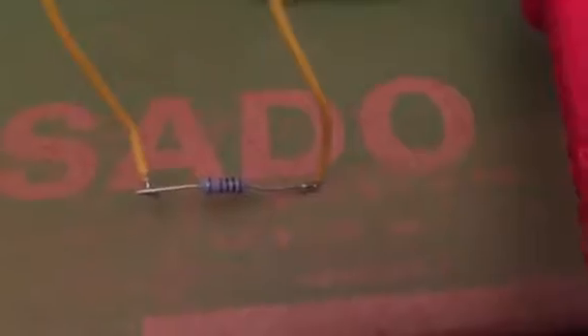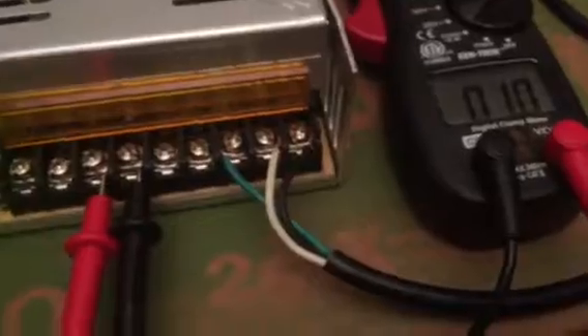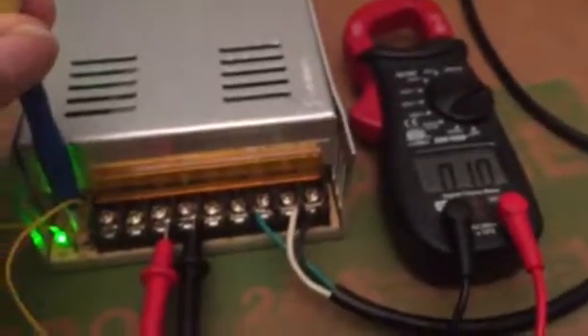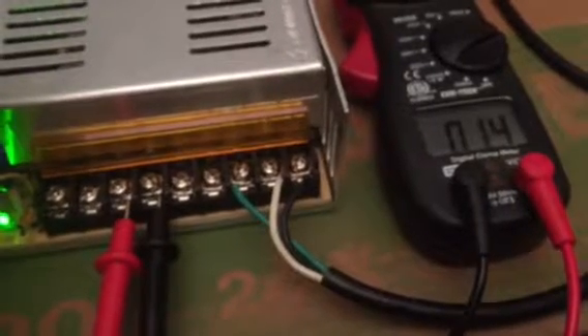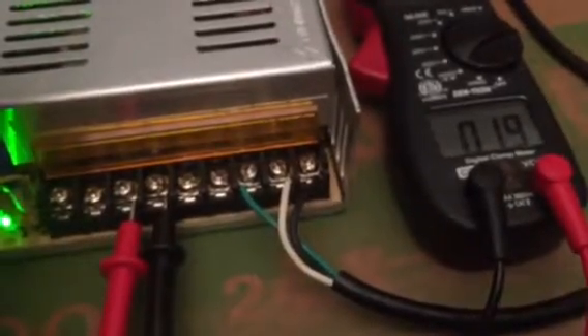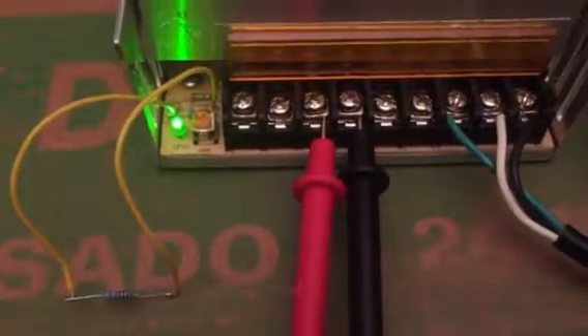What I've done here is put a 1k ohm resistor in R40's place. You'll see that all the way down the voltage is around 10-11 volts. With a 1k ohm pot in R40 and using the VR1 voltage potentiometer, on the bottom end it's around 10 volts and on the top end it's around 19 volts. So that mod is definitely a good mod and it does work.